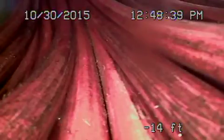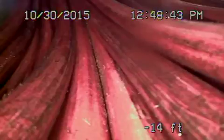Coming back, the cast iron is heading underneath the concrete driveway and looks in fair condition. So our recommendations are: number one, repair the 4x6 transition with a clean-out installed; number two, hydro-jet the 6-inch clay pipe in the street; number three, repair the section of pipe on the side of the garage where the cast iron is cracked with roots coming through; and number four, run a big snake to grind out some of the rust buildup.